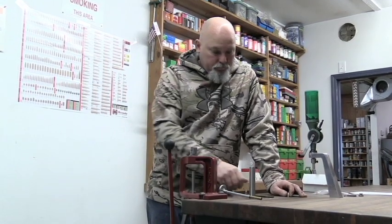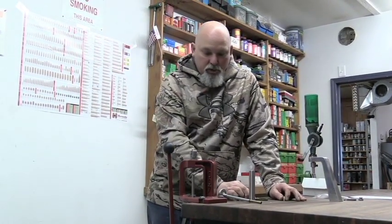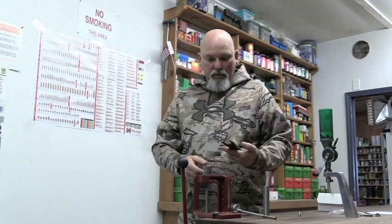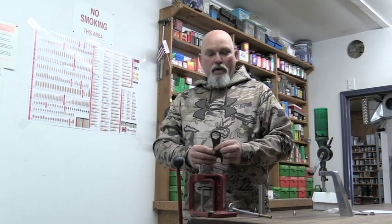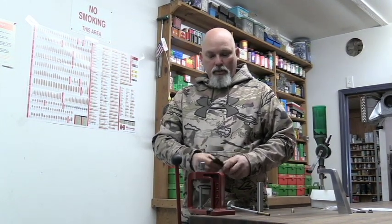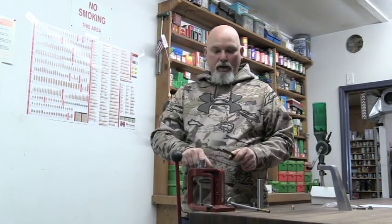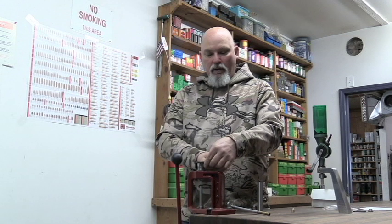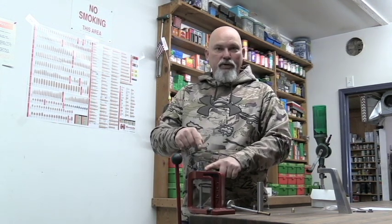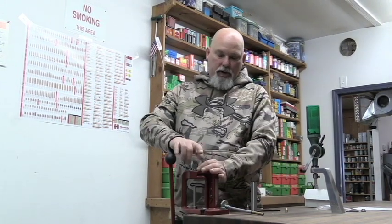So that's what you get, fellas. I hope I answered all the questions. Now you can understand how it works. Now this wrench, let me tell you something else. The wrench that comes with it, you've got a boxed end for tightening the nut. You've got an open end to take it back out of the press. So use the open end to take it out of the press. Don't use the box end to take it out, because you could loosen the setting on your nut and then you have to start all over again.